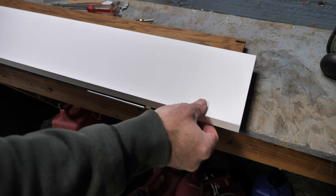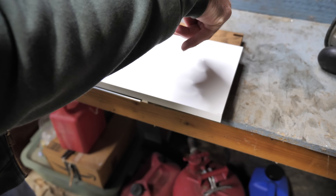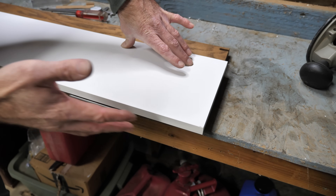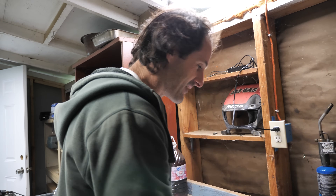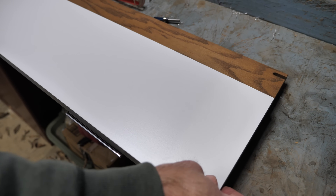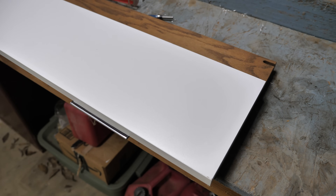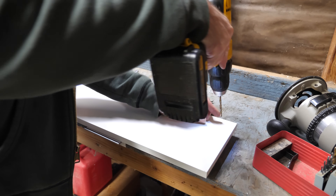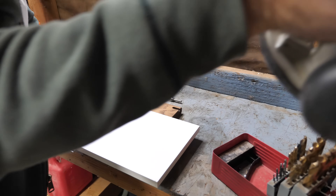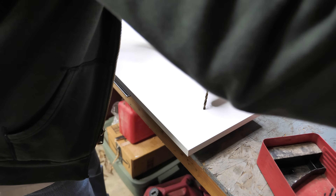What I need to do is first drill a couple of pilot holes in my shelf to affix it to the work table and then bring the router to it. I'm not saying that I want you to fail, but it sure would make for an interesting video if this didn't work and you spent what for you is a lot of money. Well, the ads on the video will at least pay for this shelf board — we ought to make at least $9 on this video. So I'll drill two holes and we'll go from there. I want to keep these holes far enough away that the router doesn't come in contact with them.